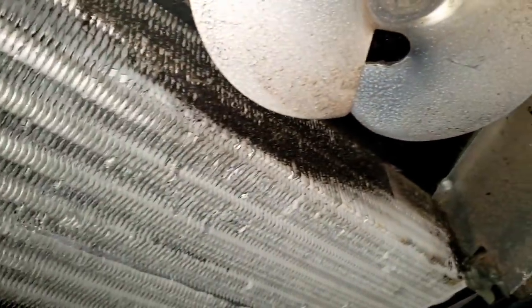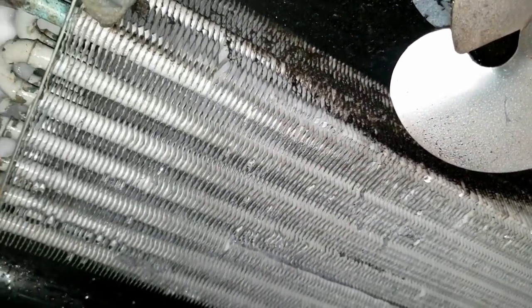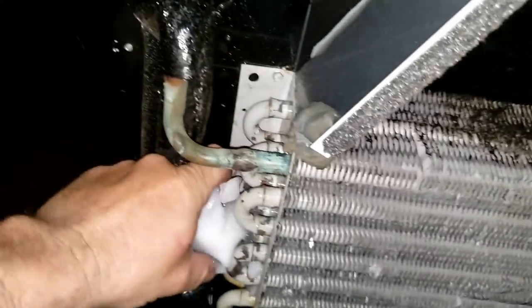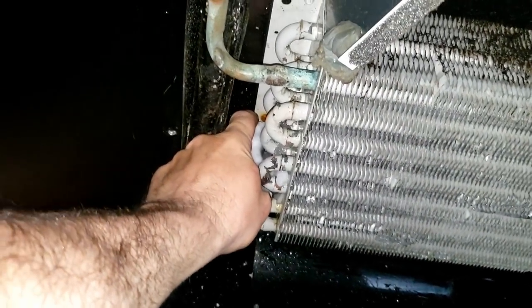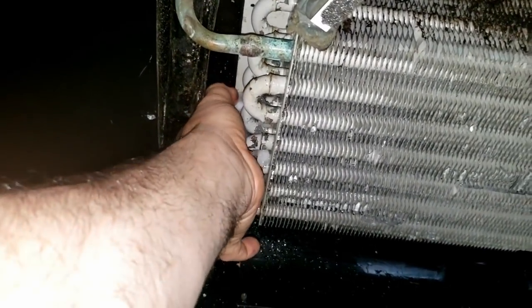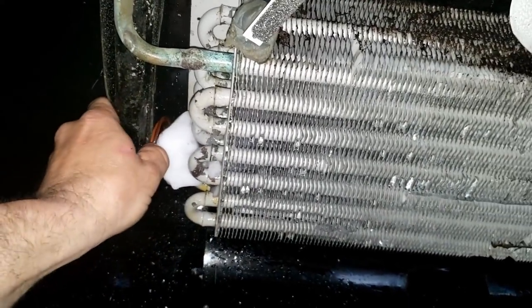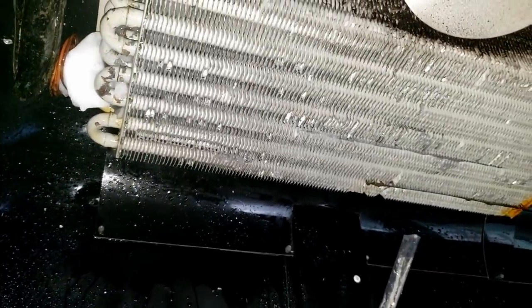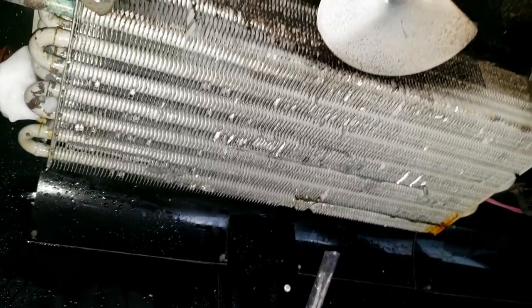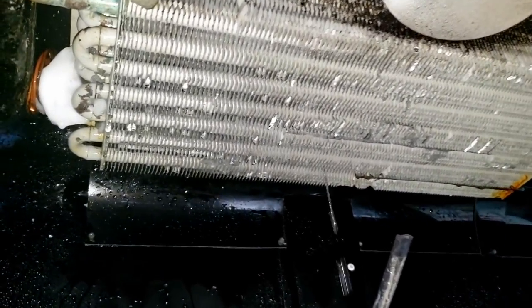You can see it's kind of nasty in there — a little more dirt on the side of the cooler. The last thing you want is to be searching for a leak and have dripping water fall into your detector nozzle — that'll screw up some detectors or plug up the tip. I'm going to try to blow these drain lines out, and if not I'll grab the CO2 cartridge.